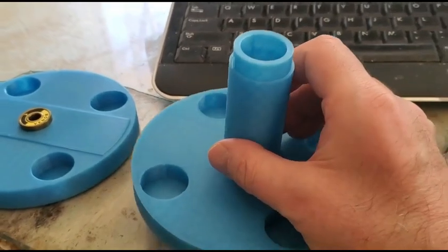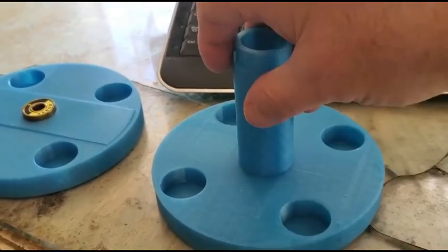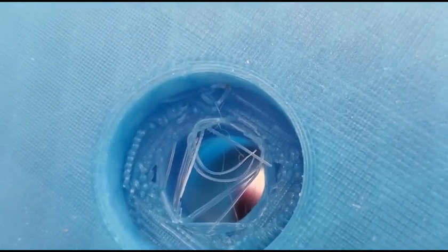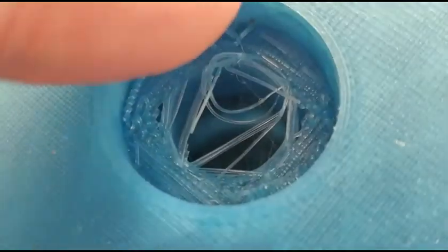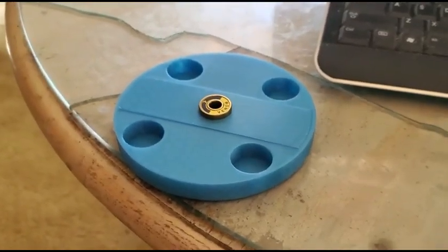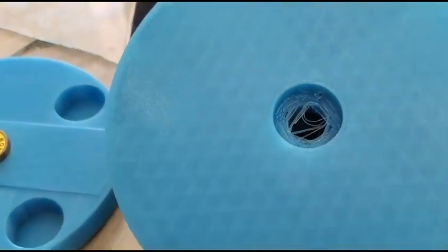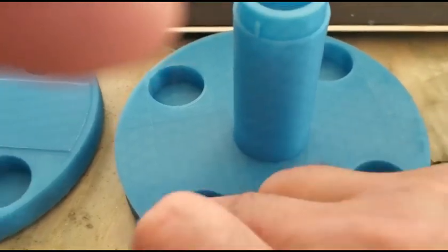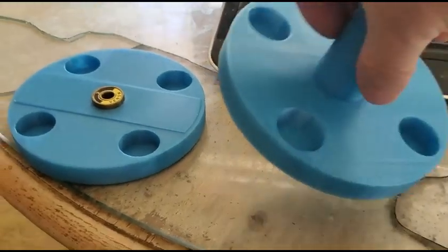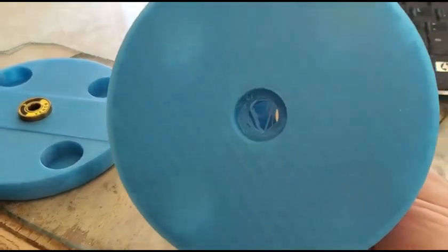The first thing I'll show you is the problem when you have an overhang that big — you get that. If you have too much PLA sagging out there, you don't want your bearing sitting half sideways because that's going to be terrible. It's tricky where you break it into two parts to get rid of that overhang. But when you actually look at it and think about it, if you carve that out there, you end up with more overhangs because you have this structure here — you can't do that. I can't figure out a way to get rid of that overhang.